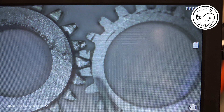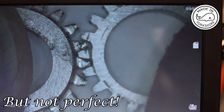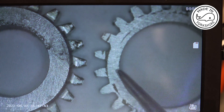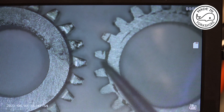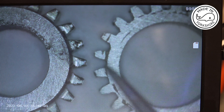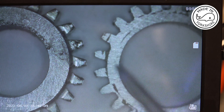The result looks pretty good. The only slight observation I've got is that the gap between the teeth is a bit squarer than that gap there. I don't know whether that's sort of normal really, but it's not 100% perfect — it's close but not 100%. I think what I'll do is cut some more gears on the hobbing machine and see what they look like.